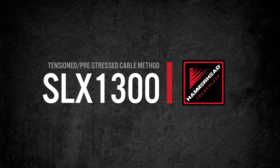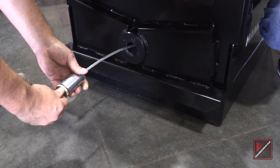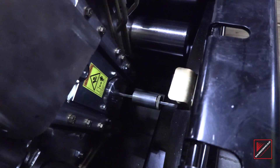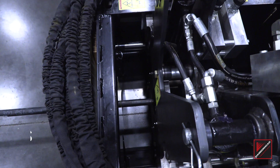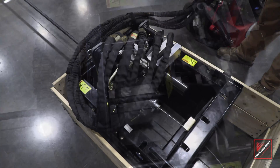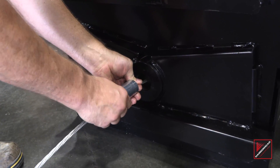If the pipe did not move at the preset pressure, stop the extraction and use the tensioned cable method. Turn off the PB-13. In the exit pit, slide a second chuck onto the cable outside the machine until it touches the chuck gate. Turn the power pack on. Slide chuck number one up to the chuck pocket. With the jaws open, begin pull and monitor the pressure gauge until the pipe moves. If the pipe moves, complete stroke and return carriage to the front of the machine. Clamp jaws, squeezing the pipe down on the cable. Turn off the PB-13. Remove the second chuck assembly.